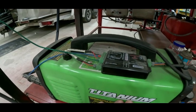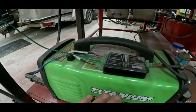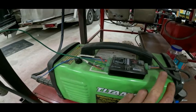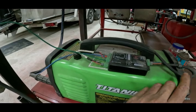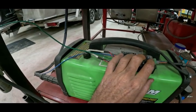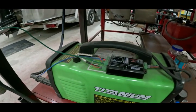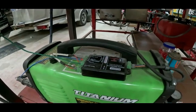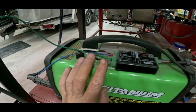Let's talk about wiring. It looks like a lot is going to it, but it's really not. These four wires right here simply run straight to the controller — there's a positive, an A, a B, and a negative. That's all there is to that, and there are the same markings and plug on the CNC controller up there, so that's pretty easy.